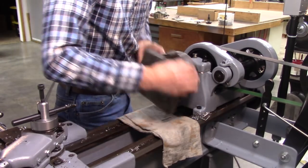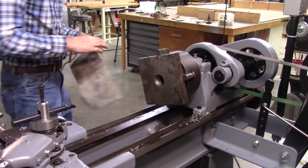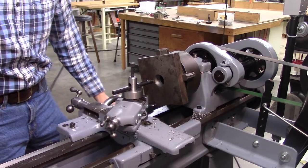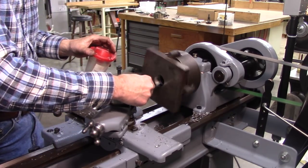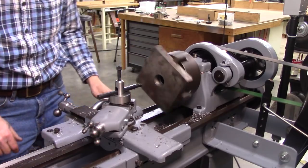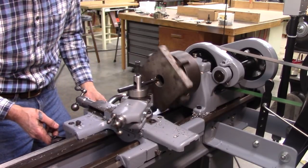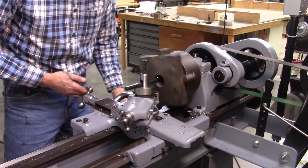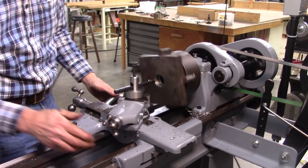I got on the internet and calculated the hole diameter based on 90% threads. They said most threads are cut at 70% — there's probably a reason for that. I'm probably cutting pretty deep threads. The recommendation of 70% is the guideline. But I thought these need to be precision. Normally you can judge thread depth when you have the sharp peak on there, and I'm past that point.